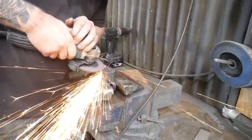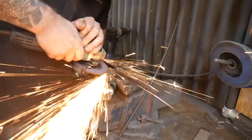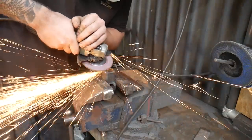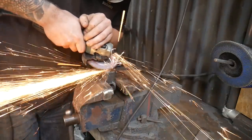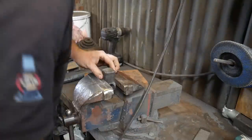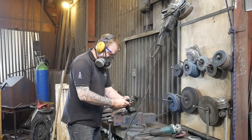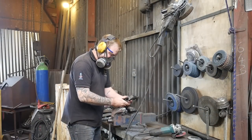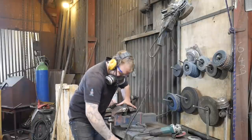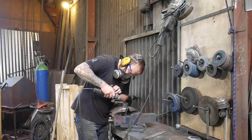Initially we're going to remove any high spots using our cutting discs or grinding stone, and then we're going to work on getting the face flat. I like to do this by doing an initial grind in one direction, then coming 90 degrees to that and doing a similar cut to take out the bias. Have a good look at it and repeat that process — this should get you close to flat. If you do have any high spots, concentrate on those and bring them down.